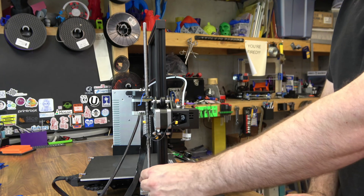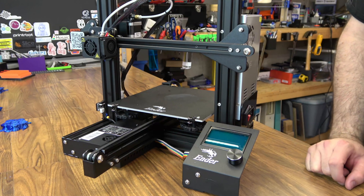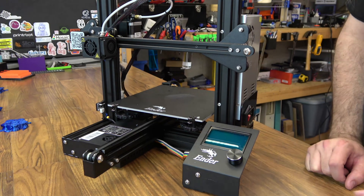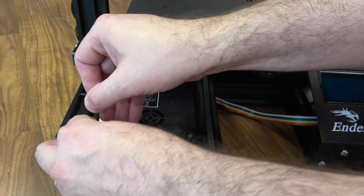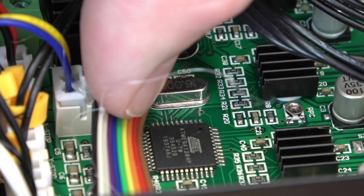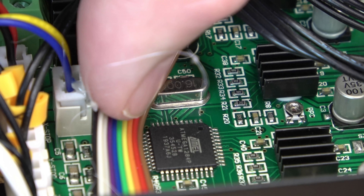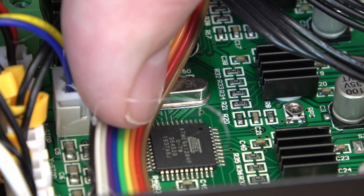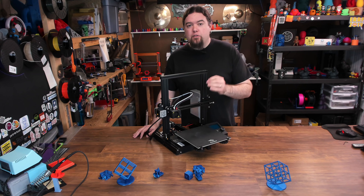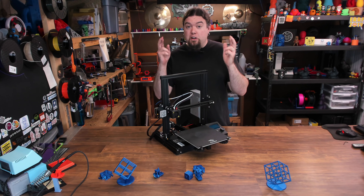It does utilize only the single lead screw on the left-hand side. Something important to note: on the original Ender 3, the Y is supported by a 2040 extrusion. Inside the control box, we have the standard Creality board with A4988 stepper drivers and the old Atmel 128 processor. It does run Marlin, but there's not a whole lot of memory on this chip for improvements. I did hear a rumor that Creality might start using 32-bit boards on all of their Ender machines, and if that happens, that'll add a lot of value to this original version — fingers crossed there's some truth to that.